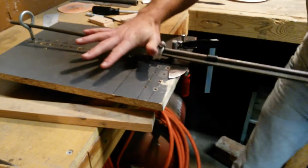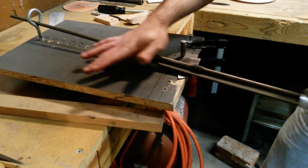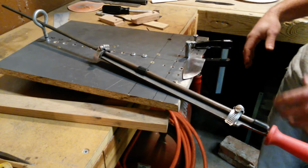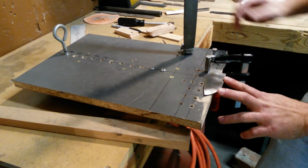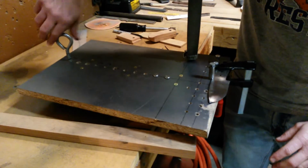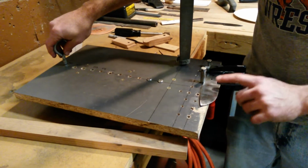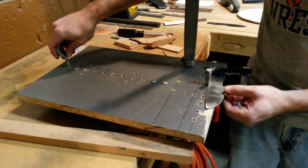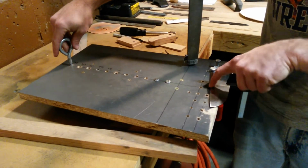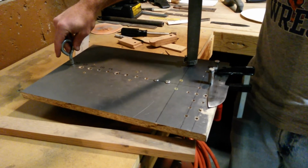From there it's pretty simple. When you've got a blank piece of stock, you'll have marked the center line, and then you'll start coming in here and filing up until you start working towards that center line, working all the way down. Might work on making a video actually showing the filing system, but pretty simple from there. Once you've filed up so far, you start getting towards your middle line. All you have to do is keep screwing this down in. It drops it down, which will raise your file line. Keep working down. Typically I color the blade with a Sharpie in here. That way as I start working towards the edge again, the Sharpie disappears and I know when I've got back towards my middle. You can take it all the way to a full grind at the edge, or in this case, like on this knife, I've stopped somewhere in here where it gets flat again. I didn't go all the way up, but sanded that away.